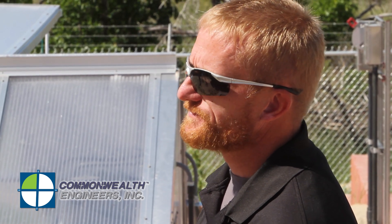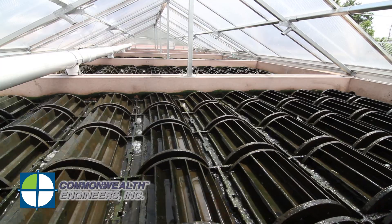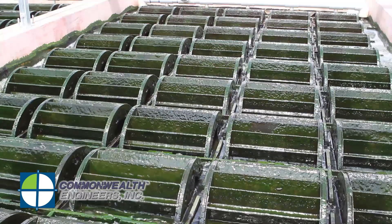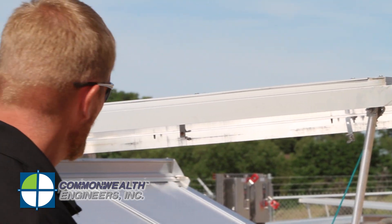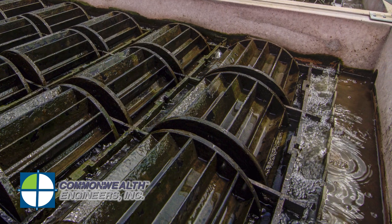Any flow that goes over the weir flows over to the equalization tank where it is recycled back into the algae wheel treatment system. The primary algae wheel basin receives influent from the diversion structure into five inlet points — there are five separate bays with 45 algae wheels per bay. The algae wheels are operated by air from a blower with diffusers run underneath each bay. This is the carbonaceous stage, where BOD must be removed before attacking nutrients such as nitrogen and phosphorus. Flow travels from each inlet to an effluent weir on the other side of the bay and into the secondary clarifier.